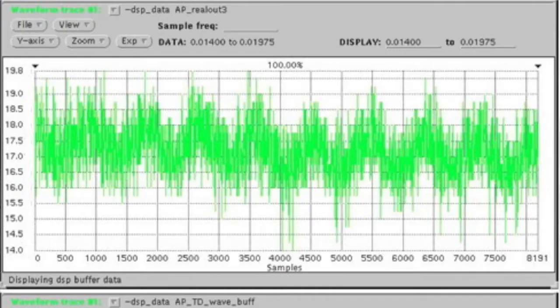Now, they captured a lot of samples and went looking for the signal using, I even hate to say it, 0.7 times the peak to get the RMS. So 0.707 times the peak gives you the RMS. And it was pretty bad. It was very noisy, obviously, because it's a very low level signal. So they would amplify the shit out of it by capturing it multiple times. That is, they started with, I think, 1,000 samples.